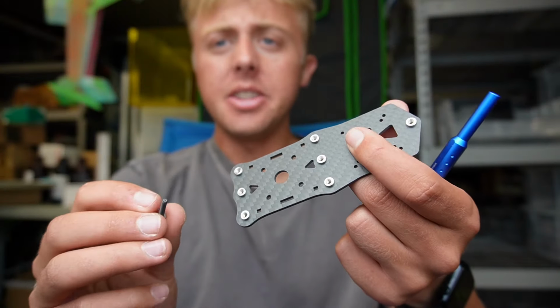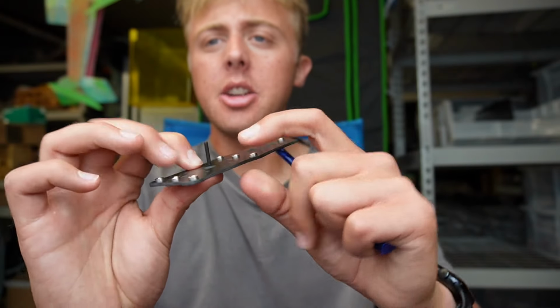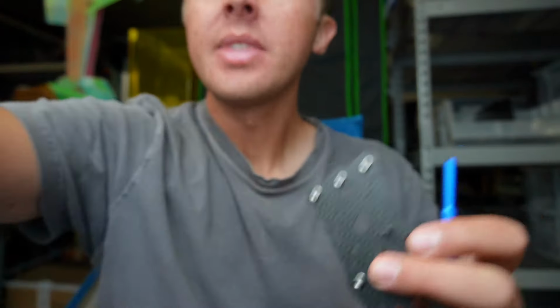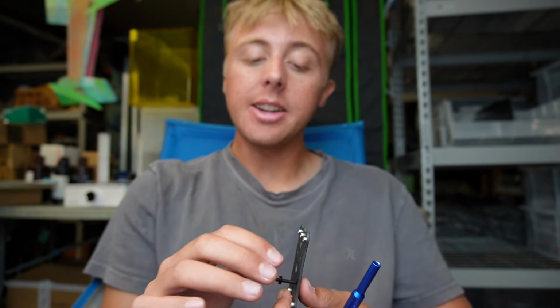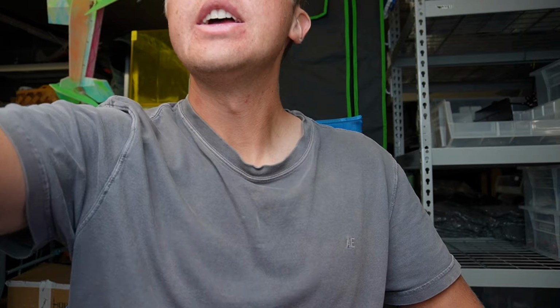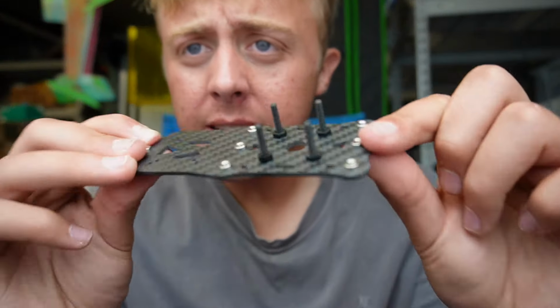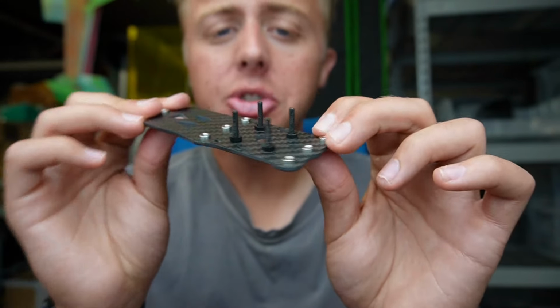Super cheap and a good thing to keep around your drone working space. So the press nut side is going to be the top. You're gonna drop your stack screws in like so. You have 1, 2, 3, 4. And because this is a slim deck design, especially when you do the split deck, this will only be a 2-high stack of a 4-in-1 ESC and your choice of flight controller. And then you should have room for your air unit in the back and a receiver, with plenty of real estate available after we have our stack screws in like so. Again, 20x20 mounting, just high enough for a 2-high stack.